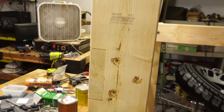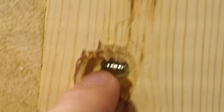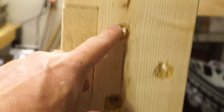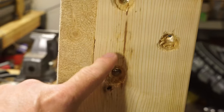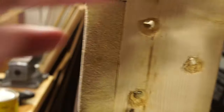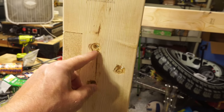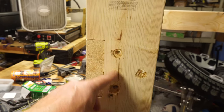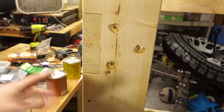I made a bit of a mistake here in that these wood screws poke through and kind of obstruct me putting the button-head screws through here. What I'll probably do is loosen them, cut them off, screw them back in, and then put a third bolt right here to secure it a bit more. It is glued, so that gives a little extra reinforcement. Another mistake I made was that I didn't countersink it initially — should have done that to begin with, but I fixed that with a three-quarter-inch drill. Looks kind of shoddy but this won't really be seen from the way the room is.